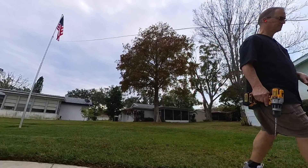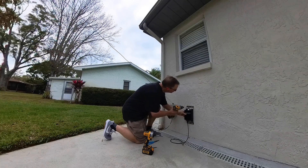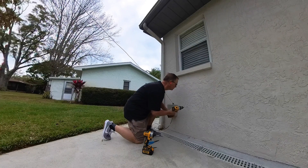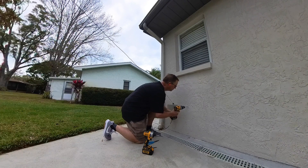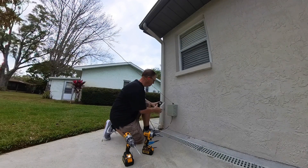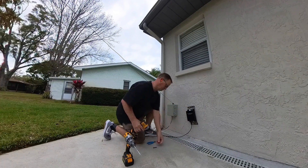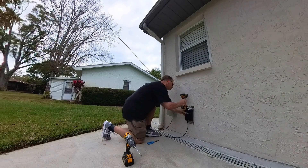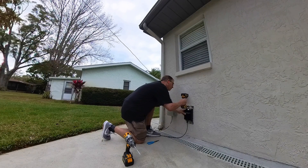Here's the view from the back patio looking up at my CHA Portamast. I use that portamast to fly the American flag — I'm allowed to have a flagpole here in the HOA. My backyard is private property and you can't get close enough to even see the wire hanging on it. So I have a compliant flagpole with an antenna wire hanging on it that nobody sees. That wire comes down to a CHA Hybrid Micro, which we'll see in a second when I open that box. When I did the original testing, I did install the tuner on the back wall, but didn't have these chrome-plated brackets. With these brackets I did need to add one new hole location. If this becomes my permanent install, I'll add two holes to the bottom and firmly affix it to the wall.